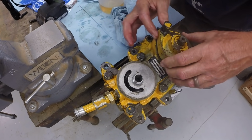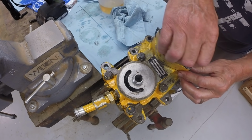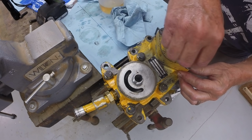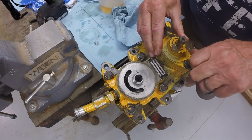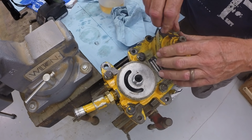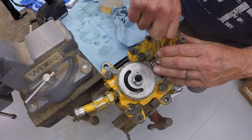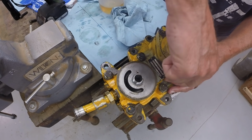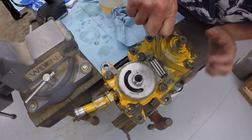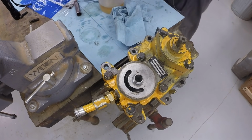It's actually needle bearings and an oil seal in the cover here at the input shaft. Sometimes these seals will leak. I've never seen one leaking. This one here in the charge pump has the high speed input shaft, so that would be more likely to leak. The trunnion shaft seals, since there's very little movement generally, I don't see them leaking very often.